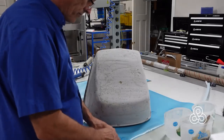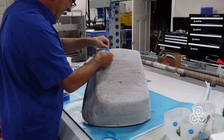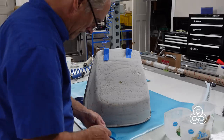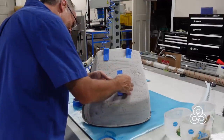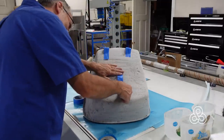Part of this lamination is covering up some fasteners — three bolts that are going to hook this thing to the floor. Just some five-minute epoxy to get the large flange bolts epoxied on, and not too long later they're cured and ready to start putting our fiberglass lamination on.